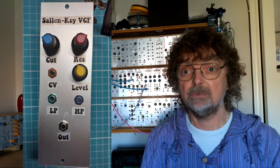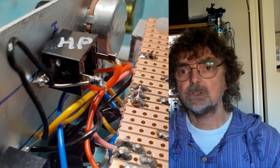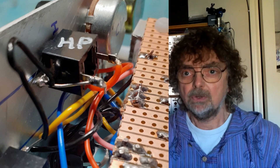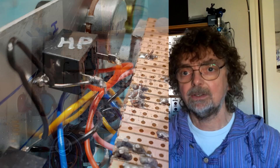What is my thing is making it work on a synth, and to do that we need to control it. Looking at the front panel, you've got cutoff and resonance — what you'd expect on any filter — then a CV input and a CV level. On the signal inputs, you've got two inputs: a low pass and a high pass. One thing to note when building this: on the high pass input with nothing plugged in, it needs to be grounded. If you use a switched jack socket and connect the switch contact to ground, then with nothing plugged in that input is grounded.